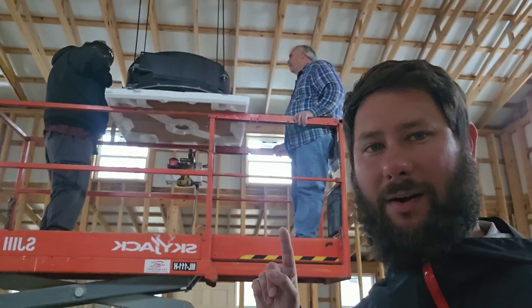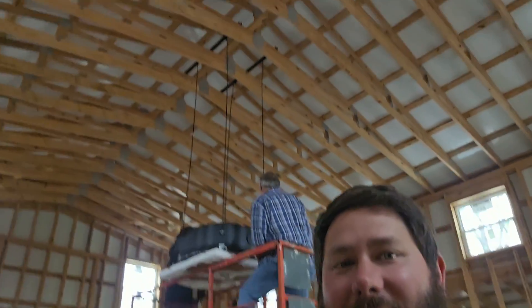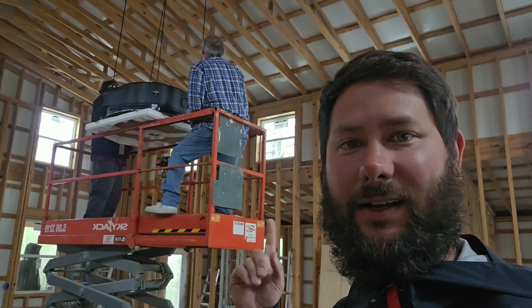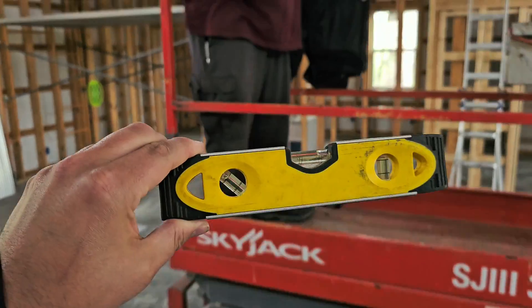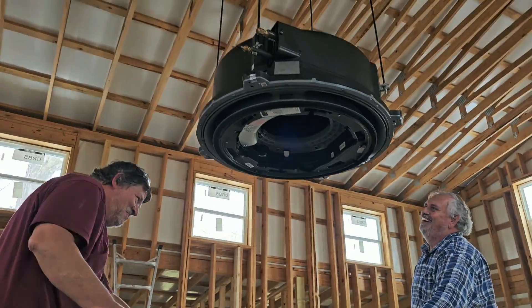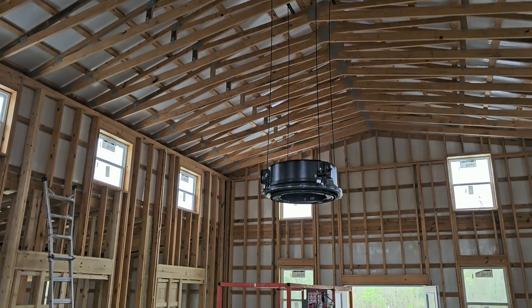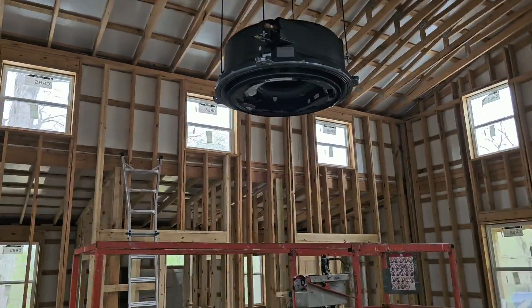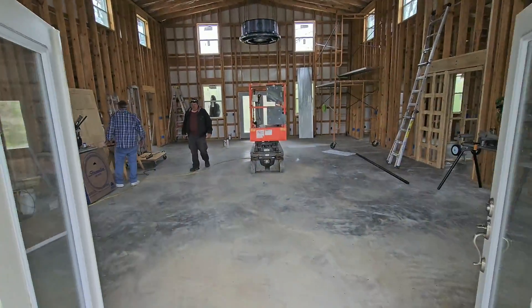First day on the job for the rough-in — got Willie and Darren. They're on the scissor lift right now. They've mounted the unistrut, got the all-thread drop down, and on each corner of that 360 ceiling cassette they've got washers and nuts connected to the all-thread — this is the way you do it. This is day one, just a few hours in. We've chosen 10 feet for the height from the floor to the cassette body. Always use a level. It looks good — you've got to level it up so nothing looks off, and I love the look of that.